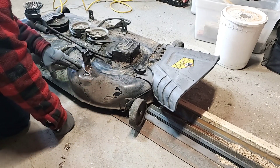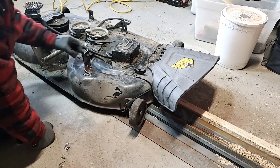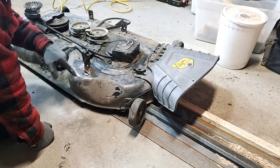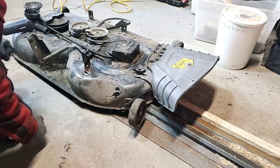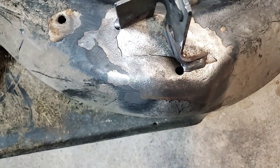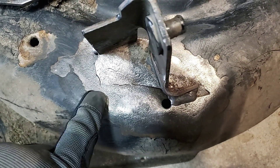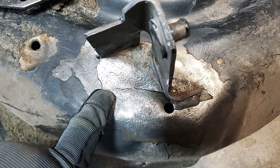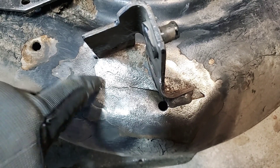So we've got a bunch of that cleaned up. One thing the customer specified is 15 inches from the outside edge of this bracket to the outside edge of that bracket, so I have to remember to place it back exactly where it needs to be. I'll clean up the underside, place it where it needs to be, and tack it. Then I'll drill a hole in this corner to keep it from cracking further. There's a crack right here and this is the only piece still holding it on — I don't want it to split further in this corner. So I'll drill a hole there, tack a couple spots, cut this crack right out, gouge it so we can get a good weld, and also gouge out the existing crack all the way around to get solid penetration on our welds.